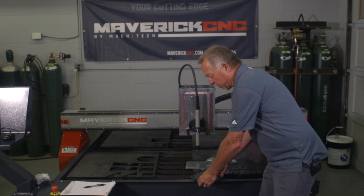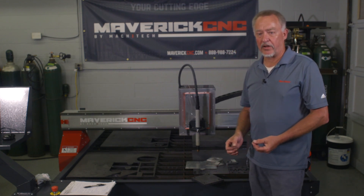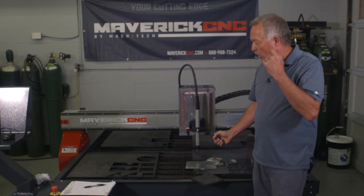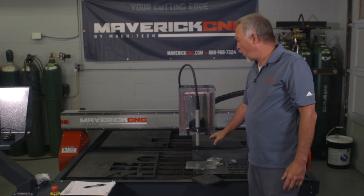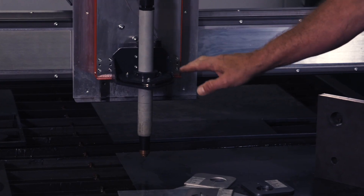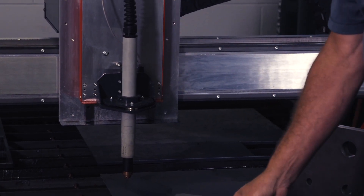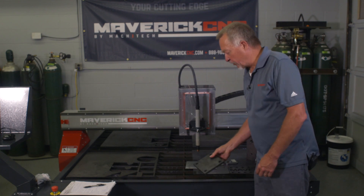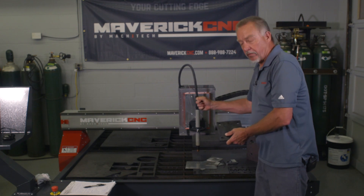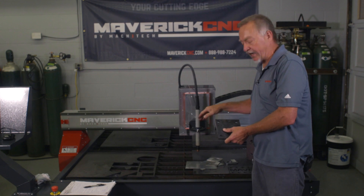Plasma is a very high-powered process that basically melts metal. The machine guides the torch around to get the correct shape, but also very critical is the electronic control — the height control specifically — that controls the torch-to-work distance, or cut height, or THC (torch height control). What's very critical when cutting a hole is to have a machine that moves very accurately with no vibration, no unwanted motion, because that can actually throw the plasma arc off a little bit.